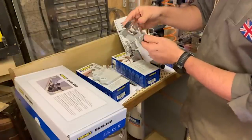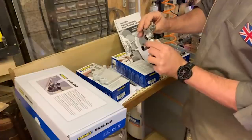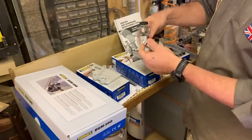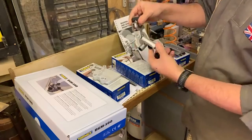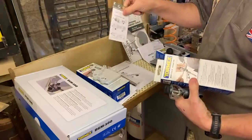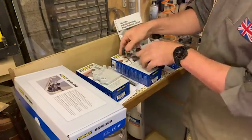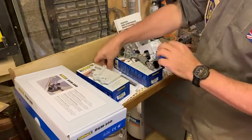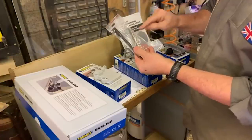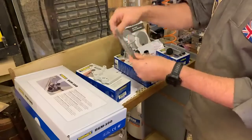Now, this is a lovely bowl gouge jig. It's got a crank knuckle here. All of my bowl gouges tend to be on jig setting 4. Again, we're going to go over that for you. But in the box, you get more labels to mark your tools just so you know exactly the angles. You get a jig for sharpening tip tools. So that's for putting into the bowl gouge jig for sharpening your tip tools. You get a pen for the labels, of course.